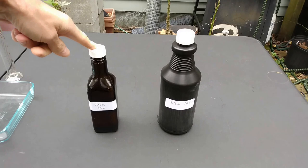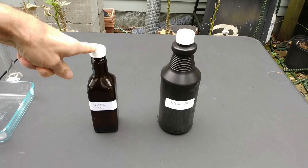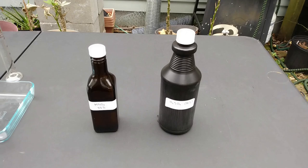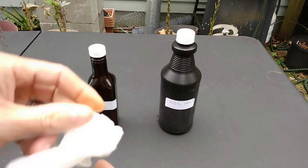However, nitric acid leaves some really ugly yellow marks that take at least three weeks to go away. So because of that, I am going to use some gloves. If you look in the description of this video, I have a link showing that you should definitely not wear latex gloves when you handle nitric acid — just watch the video and see why. So what I'm using here is vinyl gloves. I checked that they are perfectly fine with nitric acid and sulfuric acid.